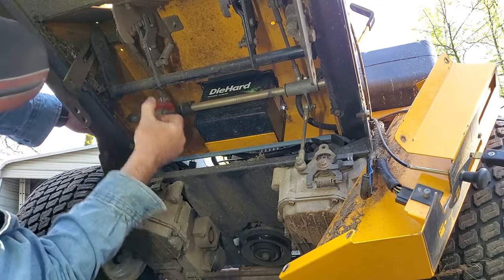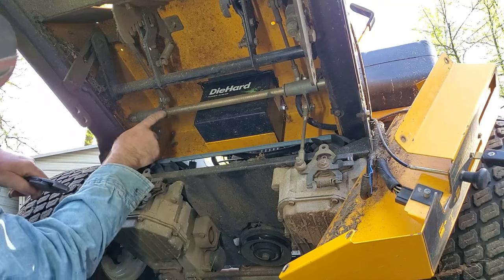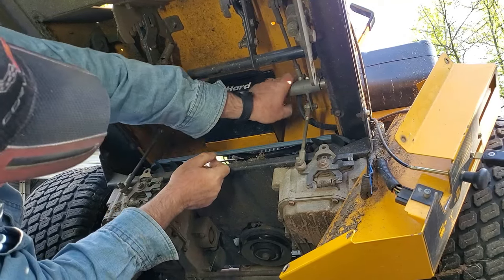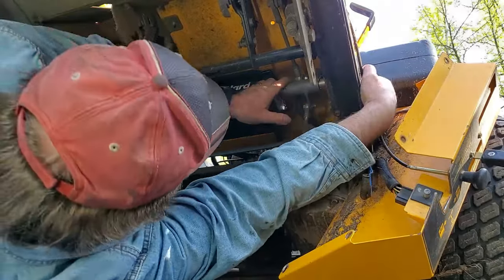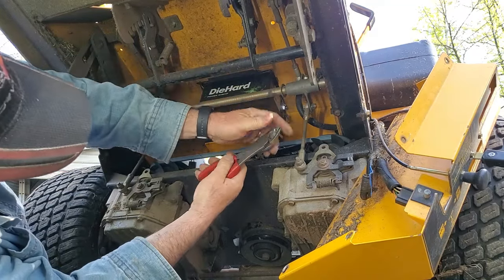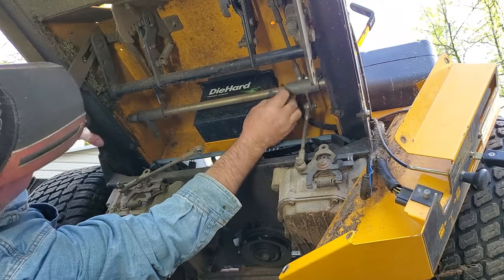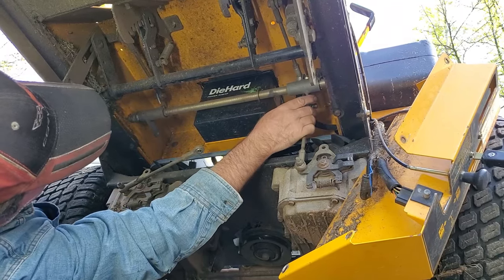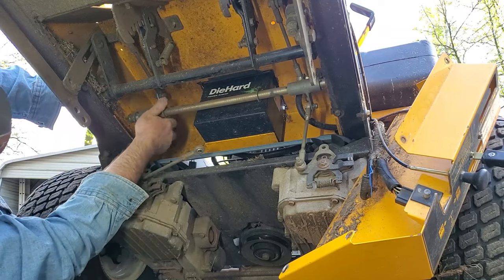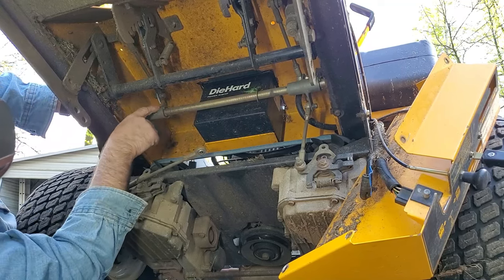There we go. Well, we're gonna make sure we lube this up. This is going to make it work easier once we lubricate inside here. This should rotate around so I can get to the cotter pins easier. Doesn't want to turn very much. So we're going to have to spray that side just to get it to slide through there. No wonder this broke. This is some place that these should have grease fittings in them.